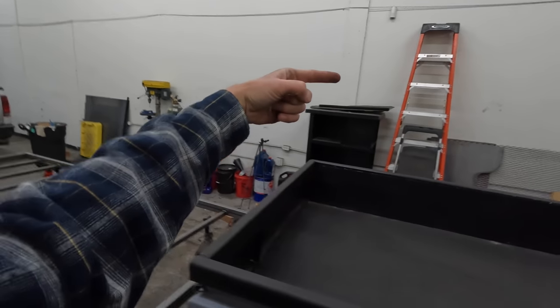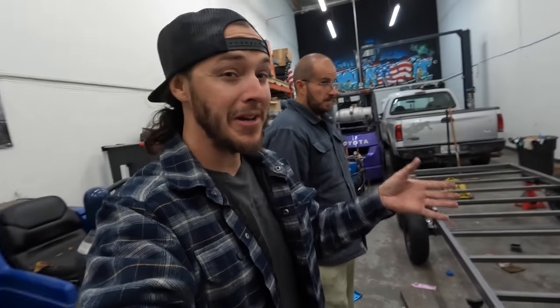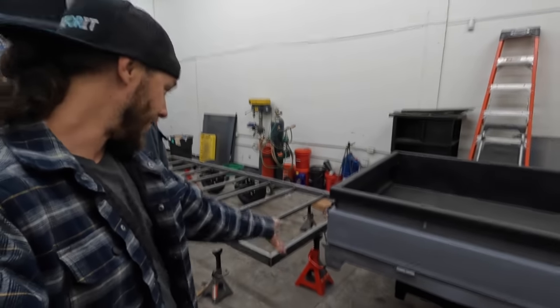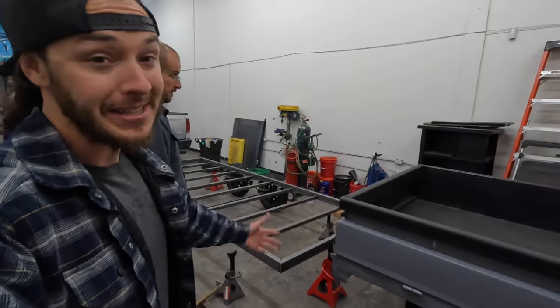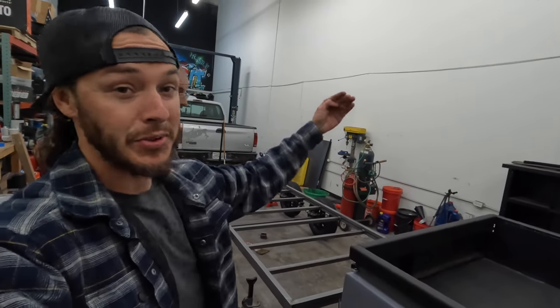We're going to have our horizontals that come in over the bed and have to hit center of the axle here. We need to make sure those are long enough that this thing can fully turn underneath it and not end up binding up and we jackknife the trailer. Honestly, I think we just go underneath at this height, but we don't want to damage anything. So we want to make sure this thing can fully turn underneath the actual gooseneck part of the trailer.